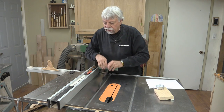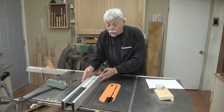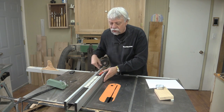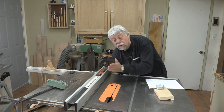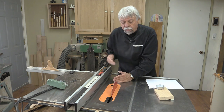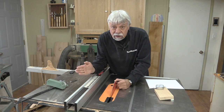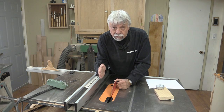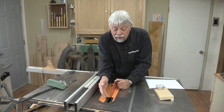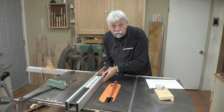The conventional wisdom is to have your fence move very slightly away from the blade — a minuscule amount — rather than being absolutely parallel, and mine is almost perfect but does move out just a tiny bit. The worst thing is to have your fence going the other way: if wood chips are coming out of the back side of the blade as you push wood through, your fence is angled in that direction. That's actually dangerous because your splitter and riving knife could jam into the work, so you really want your fence aligned not only for good cuts but also for safety.